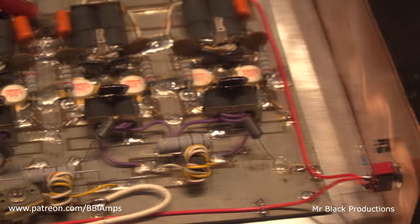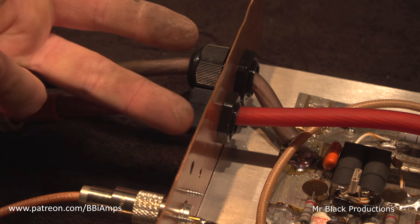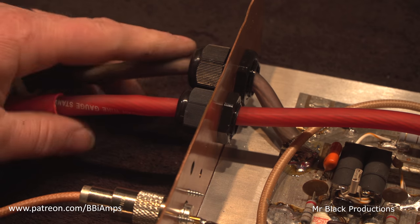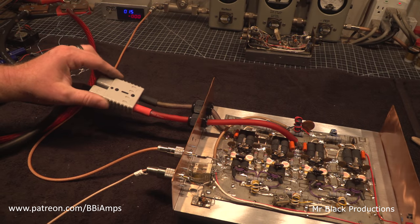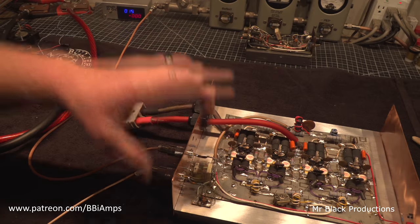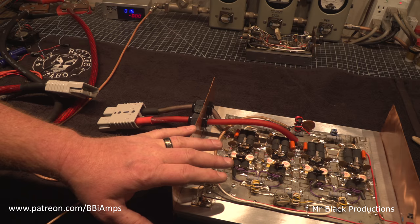Put a new power wire, new LED, new on-off switch. Put brand new coax connectors with brand new mounting hardware — actually put strain reliefs. I drilled these so the wires are even; previously one was a good quarter inch higher than the other, and there were no grommets. Went ahead and added a 150-amp Anderson clip, because I'm really trying to push the idea of that being the new norm — put a clip really close to the amp so we don't have a lot of current loss. Took the whole relay apart, cleaned it, made sure the contacts work. Put new double-sided stick tape in all the right places. The keying circuit is now taped down instead of just floating.